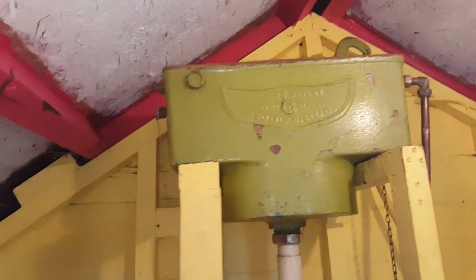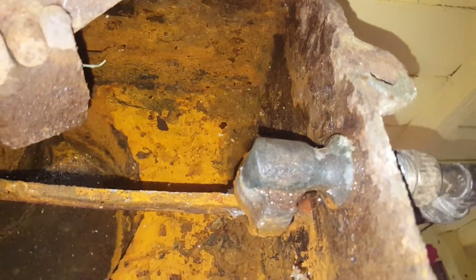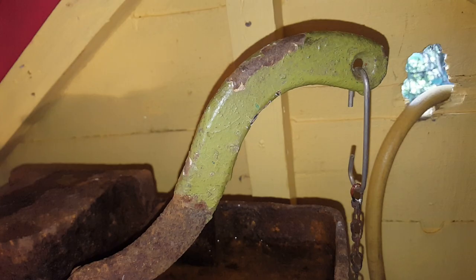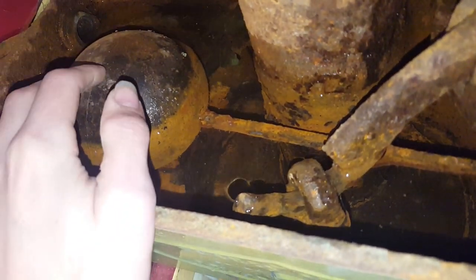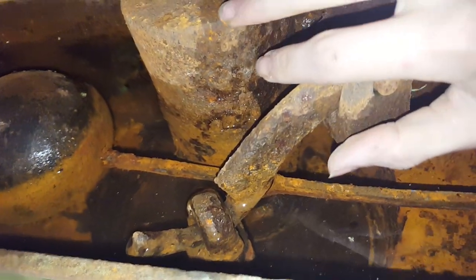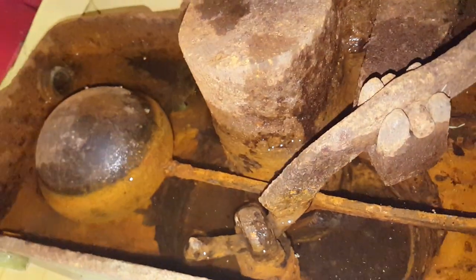Now to show the interesting flushing mechanism — the main reason I bought this, because I didn't know what it was. It still has the original Croydon valve, which I thought was a low pressure one, but it's actually made of heavy cast iron — it's a high pressure one. It wasn't filling up at all when I first turned the water on; it was blocked up with debris. Basically it's this big old cast iron weight block that pushes water down, and then it travels up in this dome and goes up to the standpipe and flushes below — which is very unique. It's a shame it didn't catch on, but it's certainly an interesting design.